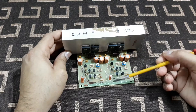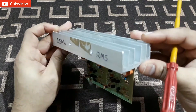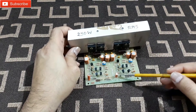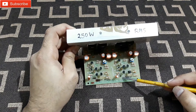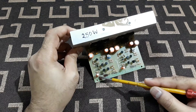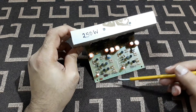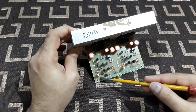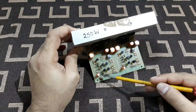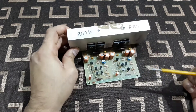All the things are the same — the pattern, the parts, everything. You can see the small capacitor; its value is 63 volt and 2.2 MFD. This is the input — the negative side is marked here as 'in', and this is the positive, this is the negative, same on the other side. The 'in L' label was covered with a marker. Now, how it became a bridge mono: you can see this input is shorted out using a jumper — positive to negative — so this input became negative. That's how it works as a bridge mono amplifier.